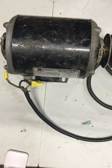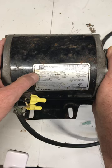The centrifugal switch consists of weights that are held closed to the motor shaft by the force of a spring. These weights hold a plate against a set of electrical contacts to keep them closed. As the motor shaft approaches its running speed, the weights overcome the spring's force and move away from the shaft due to centrifugal force. This pulls the plate away from the electrical contacts and opens the circuit.